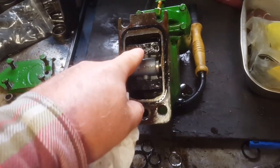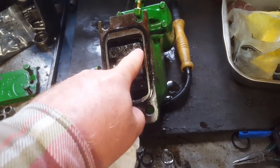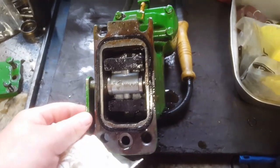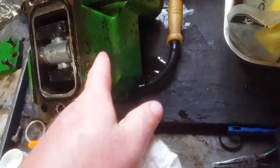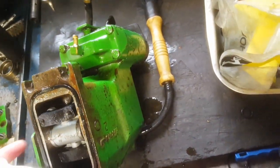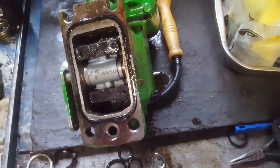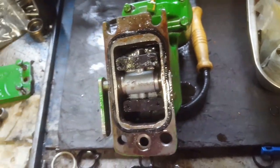So on the back side, you just take these rubber covers off. They're just to replace a lock nut. They're just a rubber there to hold the screw. Pull them two off and you can see where the roll pin goes through the lever. Pop that roll pin out, and then you'll see the cams here. Now on the older series, you'd have a plug on this side, just like you have a plug on this side, and there would be a screwdriver that you would loosen them cams in for setting. But on the 50 series, you don't. They're floating. You can see the cam, how I just moved that around, so they're floating.